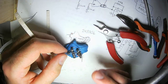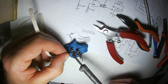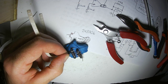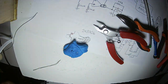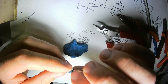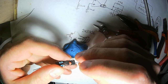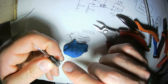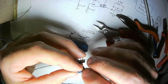A little cold. I'm gonna redo those two. That looks a little better. I get to throw these pieces of paper away. Yay! And then I'm gonna send these to ground, which means bending them toward this ground right here that we already took care of, that connects the plus pins of these four op amps and through that really thick lead.